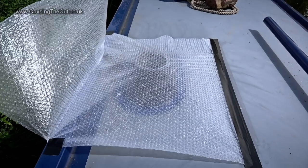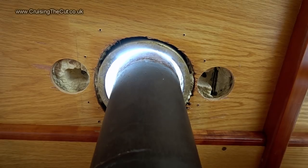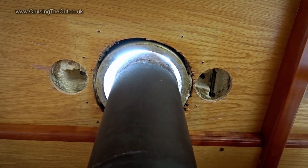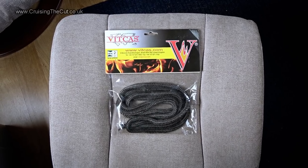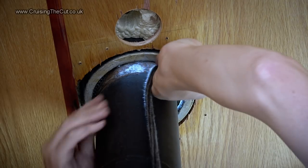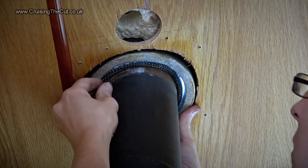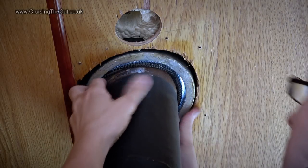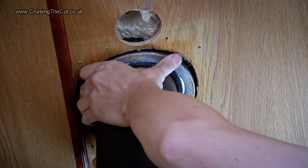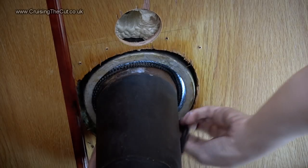That wasn't the end, of course. Inside there was still the gap between the flue and the collar. Traditionally, stove rope is shoved up to hold the two apart, so I bought a brand new length and stuck it up the gap. While you're doing this, it's held in place by friction and blind faith, and there was one side where the rope wasn't thick enough, so I had to add another piece. A little bit of wiggling of the flue was also required.